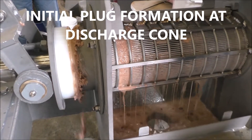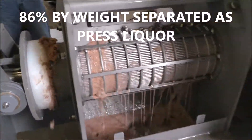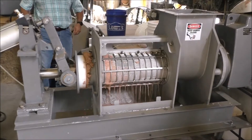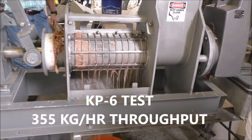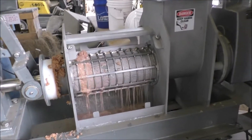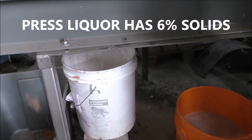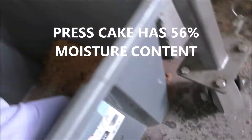Plug forming. That's channeling out there. We've got a clock now — it's time to do a time test. Got a plug, we'll start a time test. We're leaving liquid all over too, not capturing all of it. Maybe about 10 seconds of bridging, a little bit of bridging. But we're running our time test — we're a minute in, collecting press liquor and press cake.